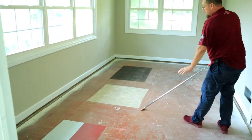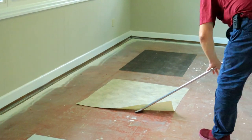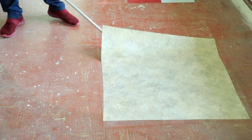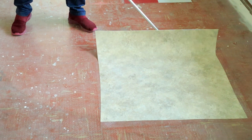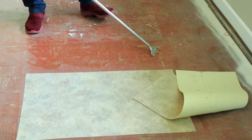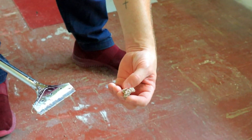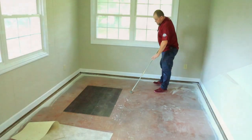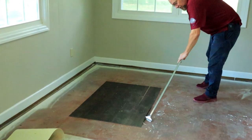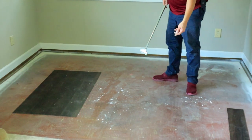Now we're going to take this 4-inch Gunlock scraper on the sheet vinyl, again at a slicing motion with the angle. I'm only going a little bit at a time, simply slicing that glue right up off the floor. You can see this is actually the adhesive that was on the floor — these razor scrapers are really good for that. Now on the glued-down vinyl plank, going in at a slicing motion — and that sliced it right up. Once again the adhesive just comes right off the floor.